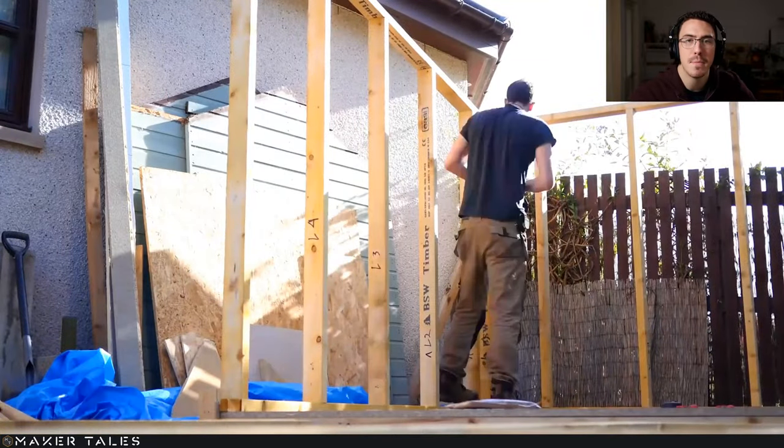Now, I've had many people ask me, how did I get this angle and what angle is that? Well, within building regulations, the minimum angle, I think, is 5 degrees. I could have done this as a flat. I didn't need to. But on this side here, I have an open field and I get crazy gale force winds coming off there. So I decided what I was going to give myself is a 7 degree pitch there,